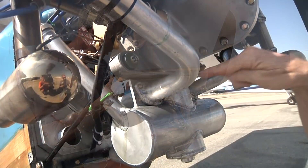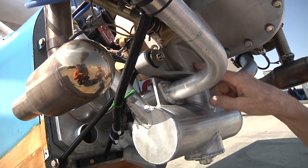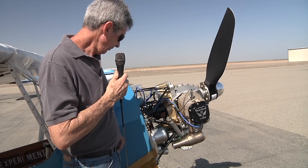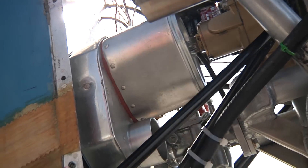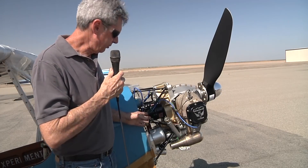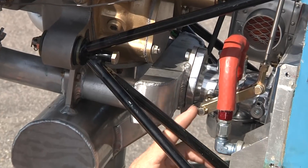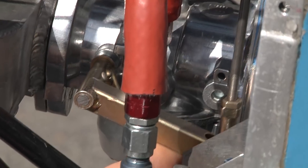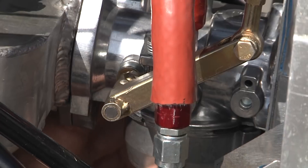This is a similar oil tank to what we had before that you saw on the previous videos. It's been refined a bit more for this configuration on this airplane. It now incorporates an air filter and an air box with a carburetor heat function. We're using a Zenith Bendix 13859 carburetor made for Harley-Davidson's 100 cubic inch Harleys, and it's been working out really well. It's got an accelerator pump and it seems to be running this little 100 cubic inch engine just perfectly.